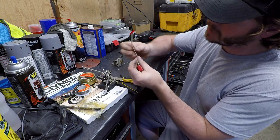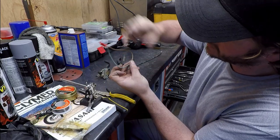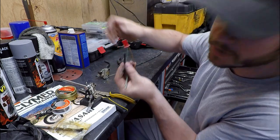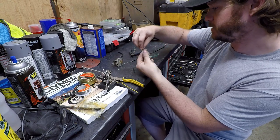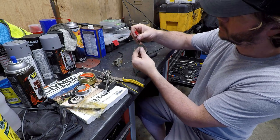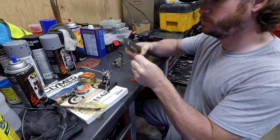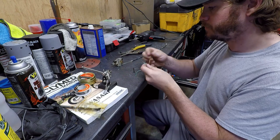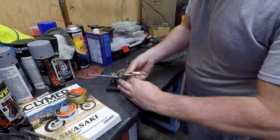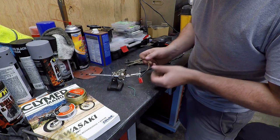What I want to do here is instead of making a loop and having a weird solder joint on an end with a big loop on it, I want to shorten one and put it in line — that way there's not as much tension on it. I want to put my joint in line right there. So in this instance it doesn't matter which one, just cut this one a little long. That'll be a good spot for that little loop. Always remember to get your heat shrink on first — that'll ruin your day.